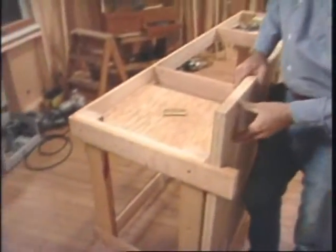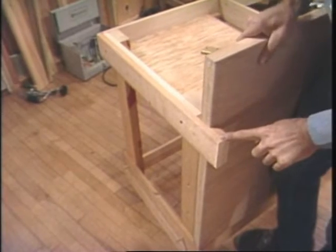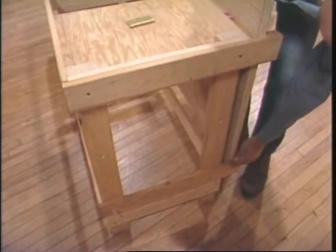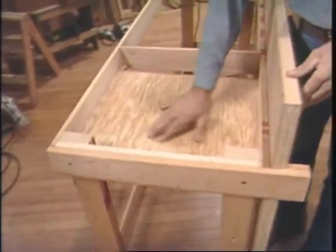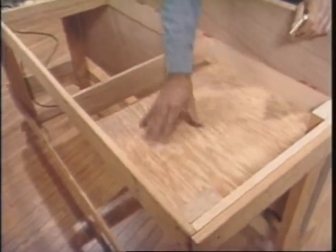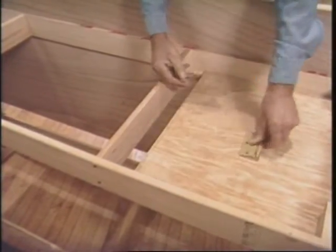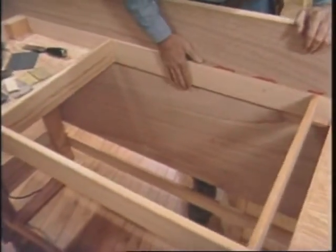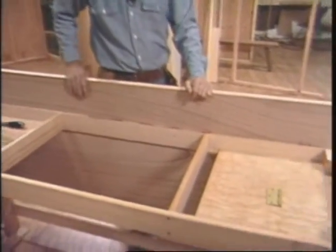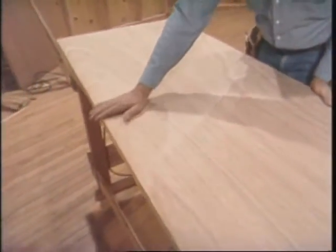This is a door bench made out of framing lumber, and it's really easy to make. It has a stop across the top that'll hold the door in place, and you can adjust it for door thickness. The rails across the bottom are adjustable, so you can use different sized doors. There's a compartment on each end that's lower than the top, so your tools will be out of the way. There's a plywood bottom which makes the frame more rigid, and it's open on the end so you can sweep out all the sawdust and debris. The middle compartment is for you — you just climb in there and grab the rails and walk away with it. The bench is only 22 inches wide so it'll go through a narrow door.